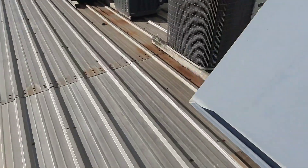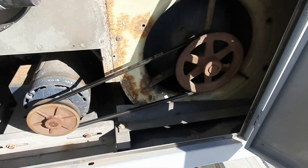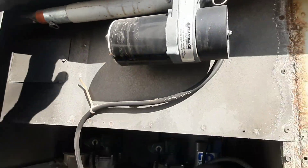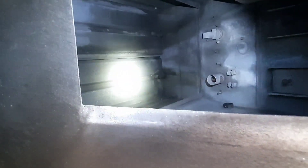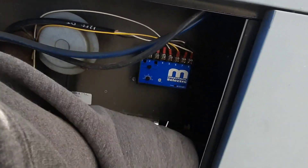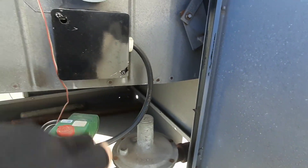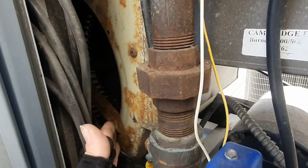There's a Cambridge up there. No blower, no nothing — let's get things torn apart and see what we've got. The belt is tight but also looks worn. Getting the damper off — damper's closed. There are all your typical limits and everything else inside, so the blower's not gonna run and the heat's not gonna fire until that opens. There's your selectra high limit. This old guy's seen better days, but I don't see anything majorly wrong with the blower.